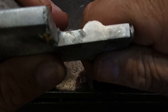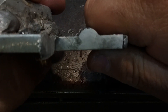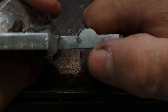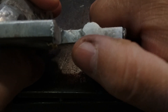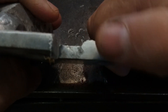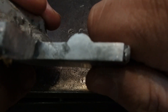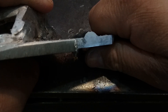There's no porosity in that weld at all. It really did a good job of penetration. The beveled part — the first weld — had maybe about 75% penetration, and the second weld had about 90 to 95 percent. It almost went into the other weld, which it shows. It really penetrated in there.